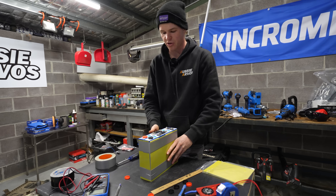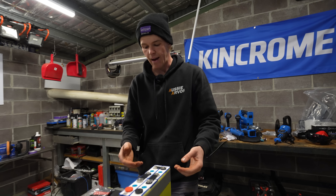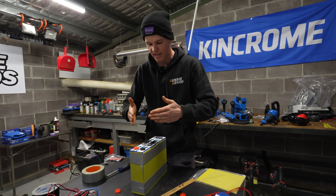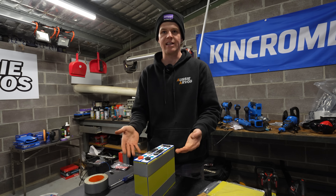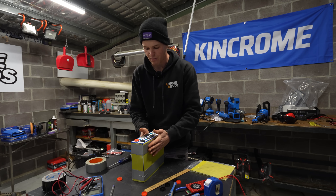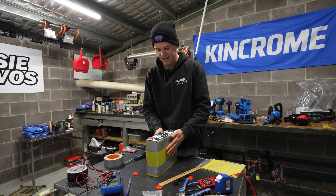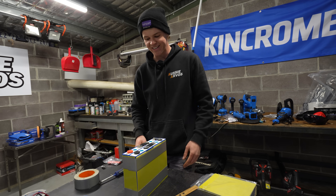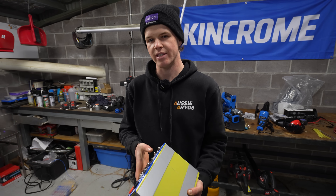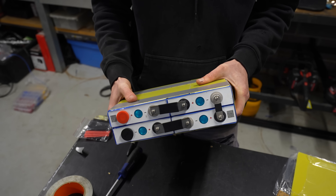That's pretty much our lithium battery essentially assembled, and it's sturdy — those cells are super tight together, which is fantastic. Make sure all your cells are square and all the faces sit nice and flush against each other and don't rock back and forth. Because these are new A-grade quality cells, they were nice and flat against each other, so we've got an awesome rectangular pack. It doesn't weigh that much — these cells weigh about 1.8 kilos each, so at the moment it's just shy of eight kilos, which is pretty good.